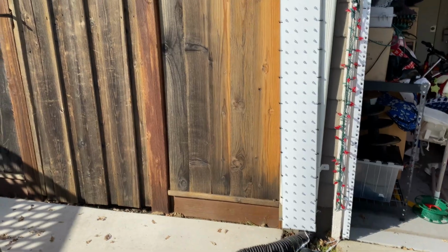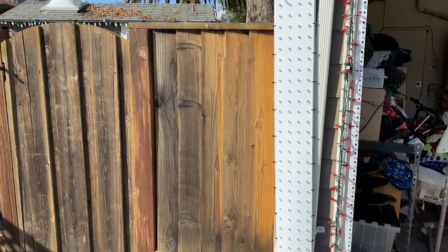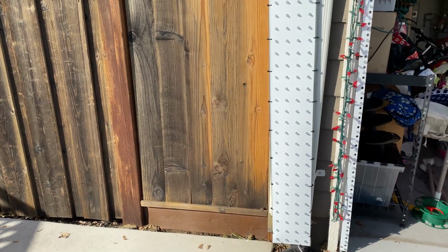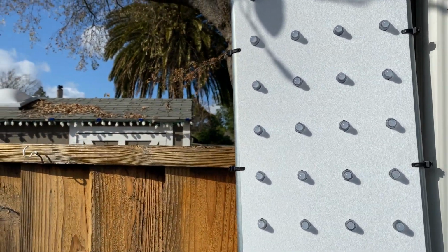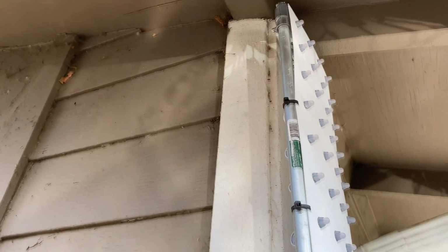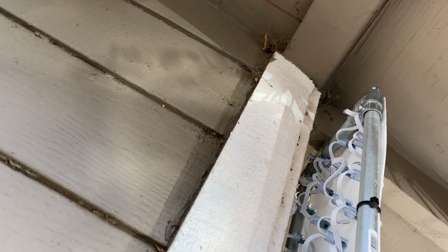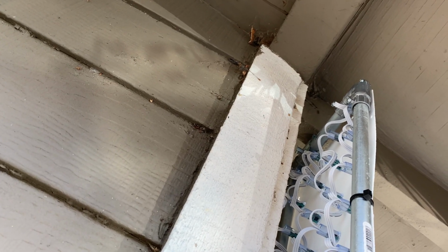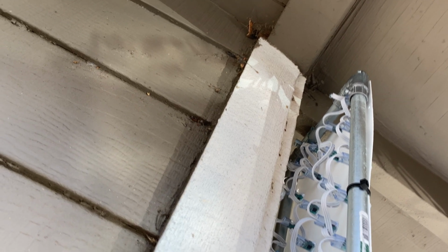Then over here on the garage, I have this, calling it a matrix is maybe too big of a word, but this is from Boscoyo. It's just a Coro sheet, came just like this as one sheet. Then it's zip tied to 1/2-inch EMT using EMT connectors there. And then I have it mounted using EMT conduit holder mount to the eave there.